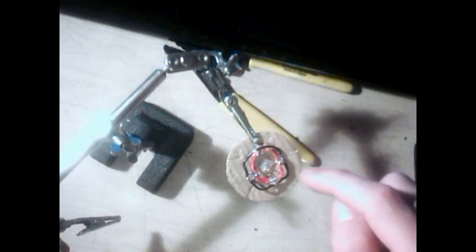So next I'm going to wire the ground LEDs all in a circle around the outside of that red ring. Alright, so I got the ground wires all wired in a circle around the positive wires here in red. The last thing I need to do for this part of the wiring is to wire the positive and ground of that center LED, which I'm just going to do a positive straight to the side and then a negative hopping over, or maybe zigzag around so I don't accidentally short circuit it over there.